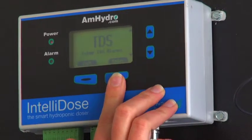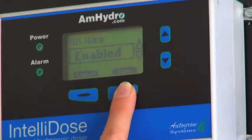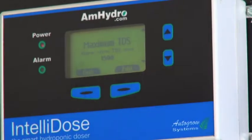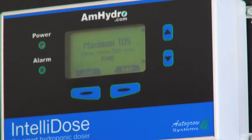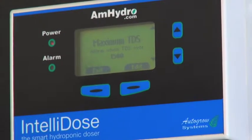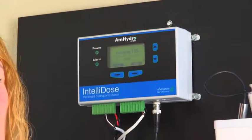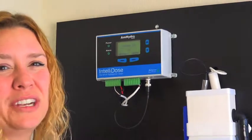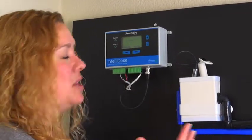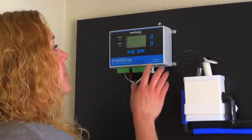To set your TDS alarms — right now it's currently disabled, but you can enable the alarm. You have your minimum TDS and your maximum. Currently we're saying if it goes below 250 or above 1500, we want an alarm to go off. As with all the alarms, we want to make sure they're a nice wide range. We don't want them too tight because things can change very quickly and for short amounts of time, and you wouldn't want alarms going off too regularly. Save those for when there's an actual problem.